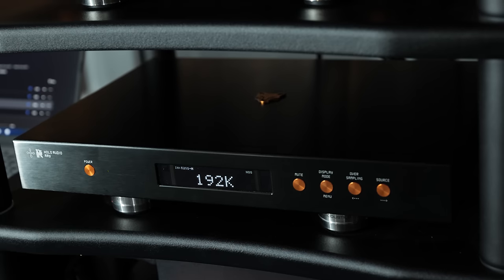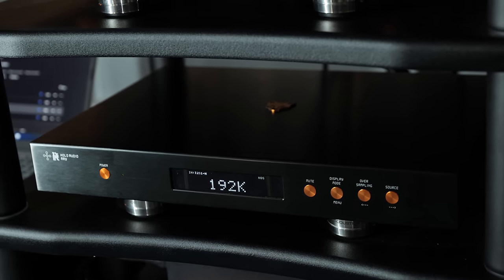I think this slight fullness in the presentation is due at least in part to the fact that in the bass specifically, it's a little bit softer than other DACs. Comparing it to the Holo May — either running both NOS or comparing with HQPlayer feeding the same upsampled PCM to both — the May was a little bit livelier and more impactful, particularly with electronic music. With electronic music, I wasn't super keen on the PCM section because it didn't quite give me the engagement factor I wanted. On Foolish Fish by Drolo, the bassline was just a little bit softer, a little bit more mushy — less tight and defined than it should have been. So while it's not objectionable, it's not the DAC I'd go for if you listen to a lot of electronic or percussion-heavy music.